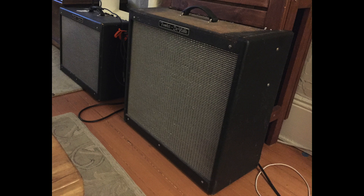Starting in the mid-90s, Fender came out with a family that basically had a 40 watt, a 60 watt, and a 15 watt amp. The Hot Rod Deluxe and Hot Rod DeVille, both shown here, are using two 6L6 tubes. The Deluxe is 40 watts, the DeVille is 60 watts, and they wind up having this split because the power transformer is stronger in the Hot Rod DeVille. The Deluxe is close in size to the original 57 Deluxe, and the DeVille is a 4x10 that lines up with the 59 bass amp. The Blues Junior runs two EL84 tubes and has basically the same circuitry but is not quite as complex.